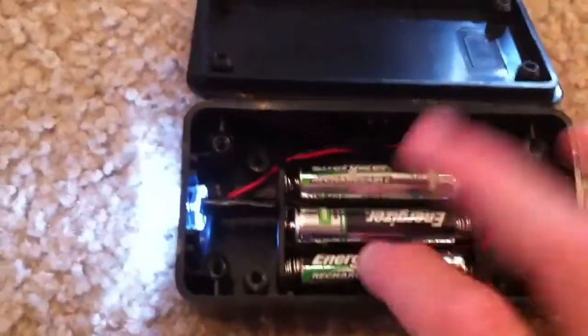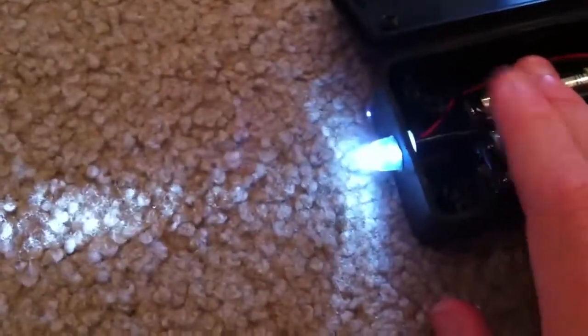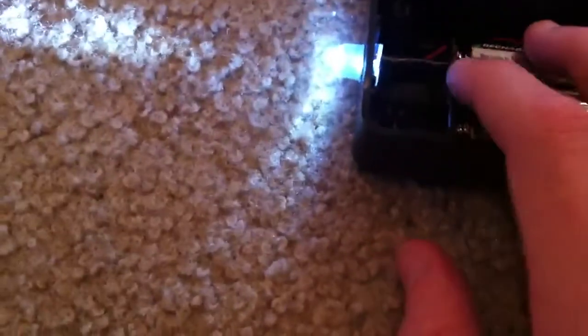It's really simple wiring — you just wire the battery casing to the LED and tape or glue the battery casing down, depending on whether you're planning on taking it apart later. The LED's max voltage listed on the page is 4 volts. I found it can go up to 4.1, but if you go to 4.2 or higher, the LED is going to pop.